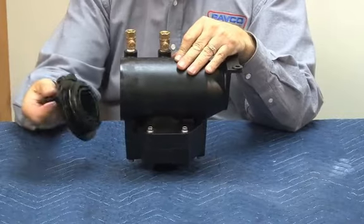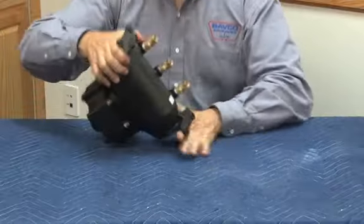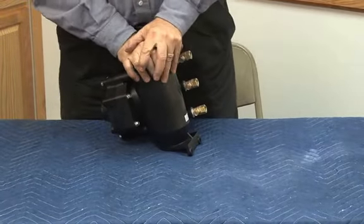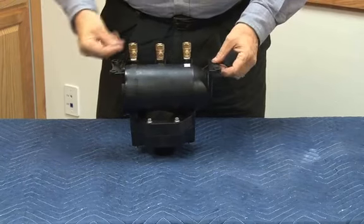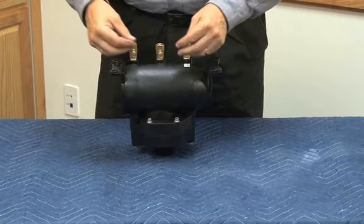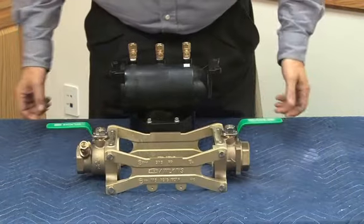First and second check are going to go in, pushing a bolt in so that that O-ring seals on the check body. Our body flange goes on next, which we now can push in place here. Properly lubricate the O-rings, of course. It means the O-ring has to be pulled out and greased all the way around 360 degrees before it's put back on. Now we're ready to bring our chassis mechanism back.